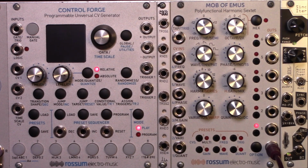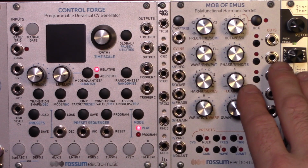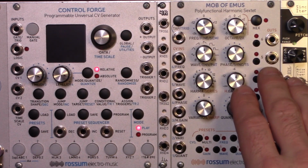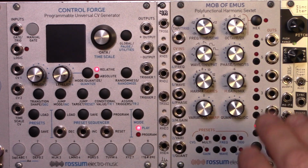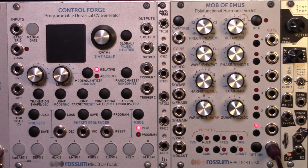Wow, okay, that is almost everything as far as operating and programming, and doing it a few times makes it pretty intuitive and easy to remember. Other things to note are that the knobs, when moved, will cause the parameters to jump to the value of the current knob state. This is currently by design with no pass-through mode available. Also, powering down and up again will restore the last state of operation whether saved to a preset or not.